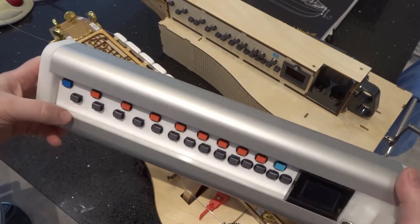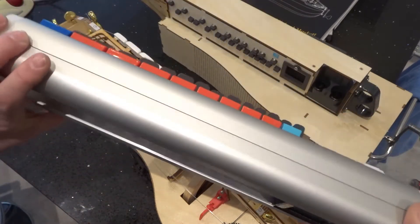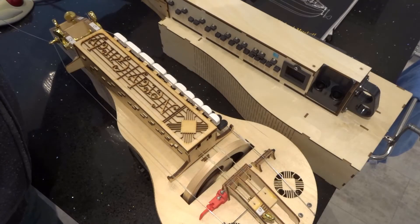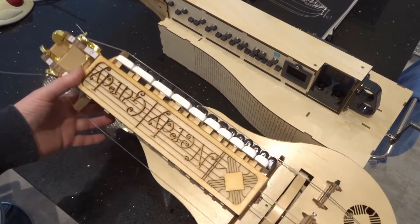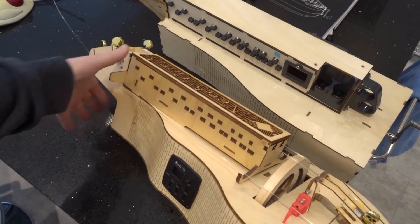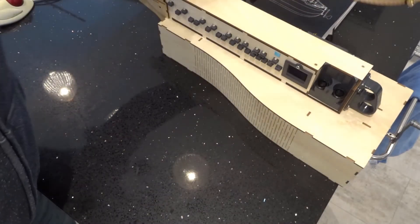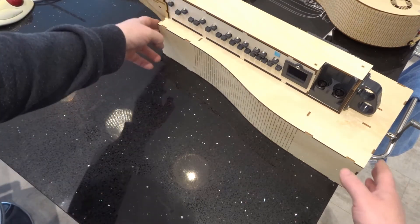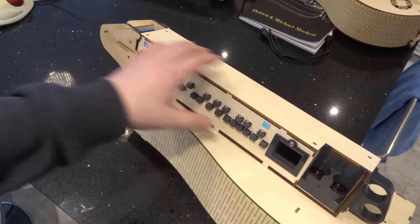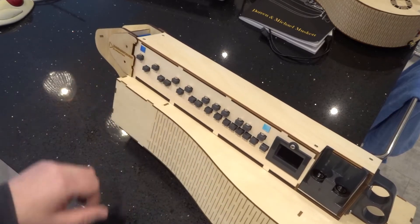The other thing wrong with it was that the key spacing — when you view them from the back — the stems aren't in quite the same place as on a real hurdy gurdy arrangement. That's because I made the mistake of putting the stems in the middle of each key. On a real hurdy gurdy the stems are not in the centre of each key, particularly with the higher notes — the stem is offset. So I redesigned the printed circuit board; now the keys are much closer to the correct positions you'd see on a real hurdy gurdy.